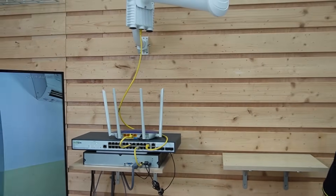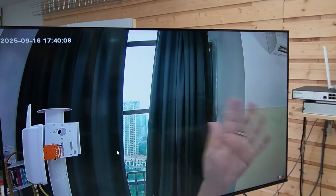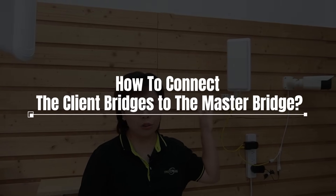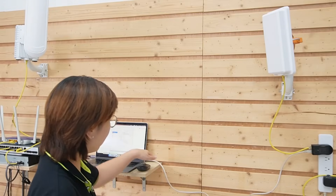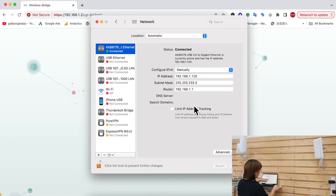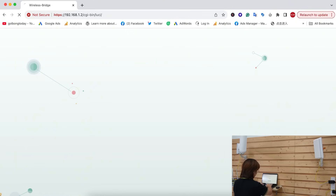So the whole setup is done. Looking at our big screen monitor, we already have one camera live because the third client bridge is already connected to our master bridge — but not this second one. I'm going to show you how to connect a client bridge to the master bridge using a laptop. First, connect an ethernet cable from the wireless bridge LAN port directly to your laptop. Then make sure the IP address and the bridge are on the same subnet, open a browser, and type in the IP address of the bridge, then enter the password to log in.